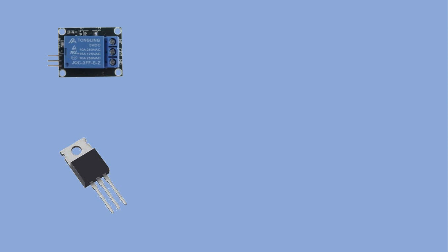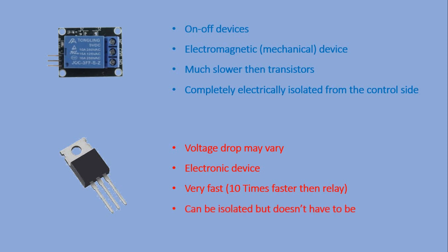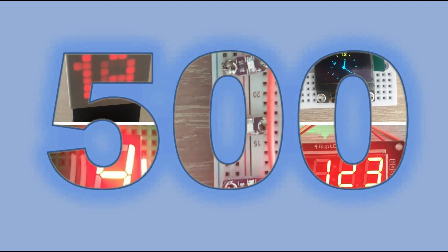So now the final comparison of relays and transistors. Relays are on-off devices while transistors can change voltage drop in a circuit. Relays are mechanical devices using an electromagnetic field to close and open the circuit. Transistors are electronic devices and as such they are much faster than relays — 10 times faster to be exact. Relays isolate the controlled circuit from the microcontroller. Transistors can be isolated from the control side as well but they do not have to be. Relays consume a lot of current in an on state; transistors don't. All in all, relays are easier to use but not practical when switching is too frequent, and they have a limited lifetime of 50 to 100,000 operations on average. This is the end of this video — I reached 500 subscribers and would like to thank all my viewers. I am working on new projects and hopefully I will see you soon.